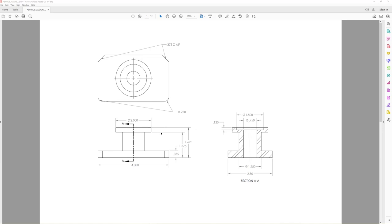We're going to draw a circle on the very top or the bottom — either one — and cut it all the way through so we'll never have to think about it again, because it'll always go through even if we change the size on it. Lastly, as far as our cuts go, we want to create this 1.5-inch diameter spot face up here at the very top, to allow facilitation of a fastener or a washer sitting on it. That's going to be the last cut that we have.